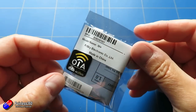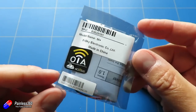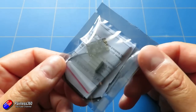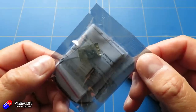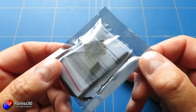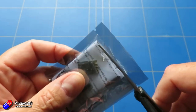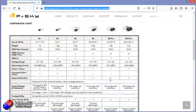In terms of the hardware, there are a number of critical differences. First of all, it only supports the ACCESS protocol, and it has a much wider voltage range support of 3.5 to 10 volts for all of the Archer receivers, which gives us lots more options for when we put them in smaller models. The lineup is pretty extensive — there's one no matter what you want to build.